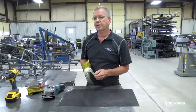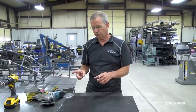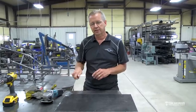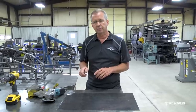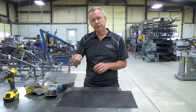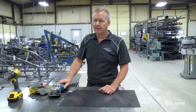Another thing that we use quite a bit is an air saw, and we use a Snap-on air saw - they are the best that we found. They're really short and easy to handle, they use a very fine blade, and they run that blade at super high speed. So for making contour cuts, curves and stuff, they cut very well. They will cause a little fracture on the edge so you will have to sand it, but for doing some really tight radiuses this abrasive cutter is gonna cut more straight while the air saw will cut more contoured curves and tighter corners.